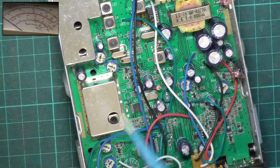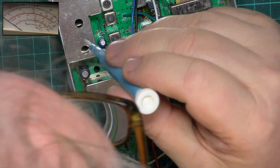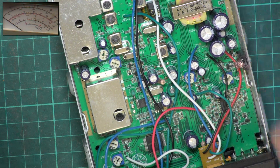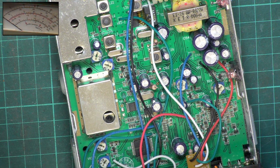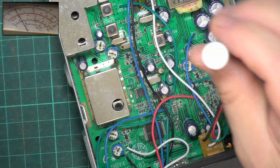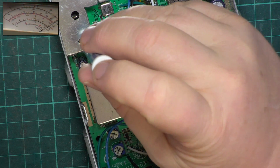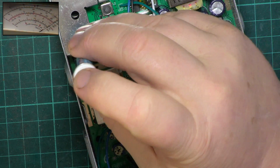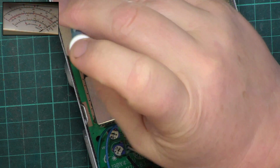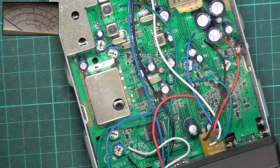So our transmit chain is clearly going to be whatever coils are in the cans, and there are 2 there. If there is one there, that'll be the 54 meg trap, so we're not going to touch that. Okay, so we'll key up. I'll go on the 3 watt range because we're quite close to, there we go, quite close to full scale deflection. That's peak there and there.